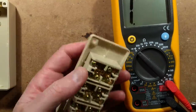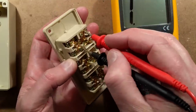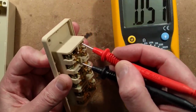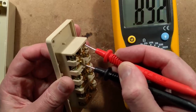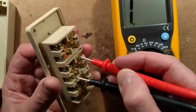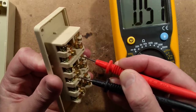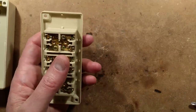Hopefully this has all loosened up a bit since I've been playing with it. Let's go between these normally open contacts and push the button — it kind of makes contact but it's a bit scratchy. Let's try the next one. You know what, I wouldn't trust this for low voltage use.